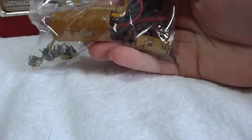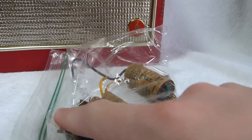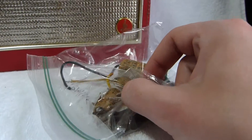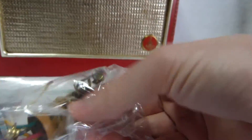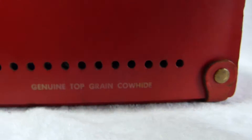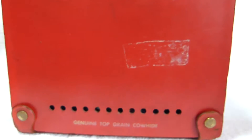Here are all the parts I pulled off the set. That's the original multi-section electrolytic capacitor for the transistor side of things. There's the B-plus filter cap and the coupling cap that couples the output of the RF tubes to the transistor section. There's the connector for the A battery and the connector for the B battery. These metal things here were clipped to the back of the radio on these vent holes — I have no idea why; it's not original, so I took them off. The original owner also put some cloth tape with their name on it on the bottom, and I couldn't quite get that cleaned off without risking the leather, so it looks rustic now.